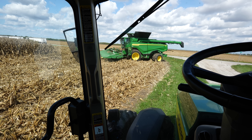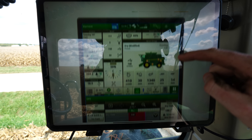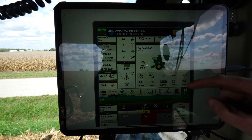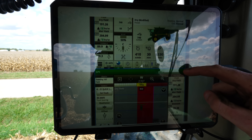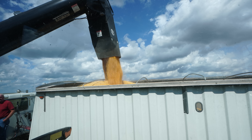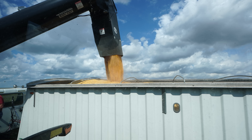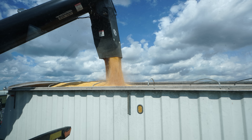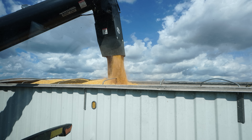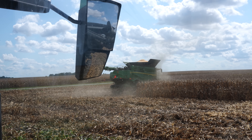I told him they may need to run the corn head lower to stomp the stalks down or those LSWs aren't going to last very long. I hope the yield monitor is off because it says this corn is averaging 189 dry bushels right now, which is much lower than I've heard from the neighbors. Could be a little wet corn from mixing in some 117-day Pioneer. If it's over 19 percent moisture we're not going to take this to the elevator — we'll just let it sit out here and dry.